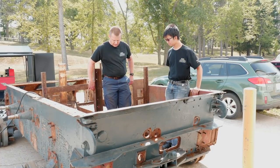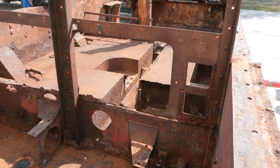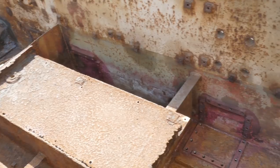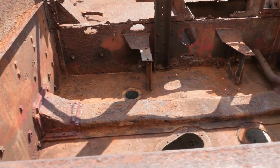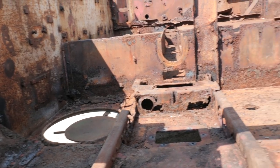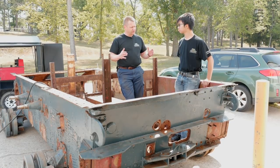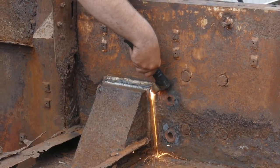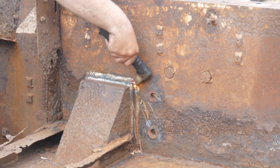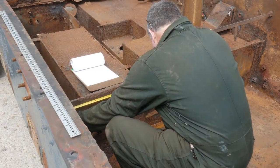So having looked very thoroughly at it and done an assessment of it, how it was manufactured was as a complete unit and slightly undersized. It was then placed in the hull, centered, and then there's filler strips all around the outside edges. So the plan today is to cut down through the filler strips at the outside edges so that the integrity of the center section as it was originally manufactured stays the same, so that an exact copy of it can be made.